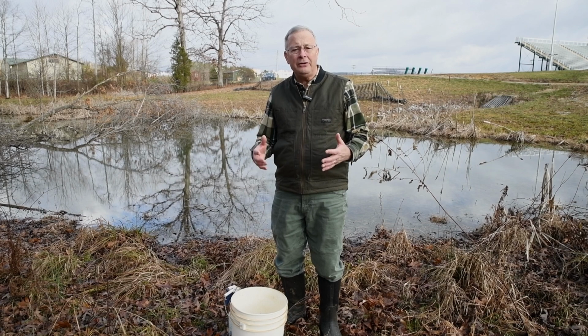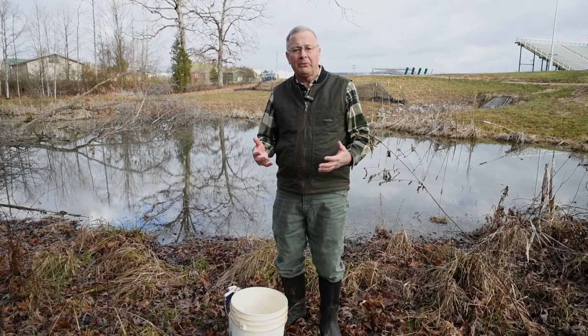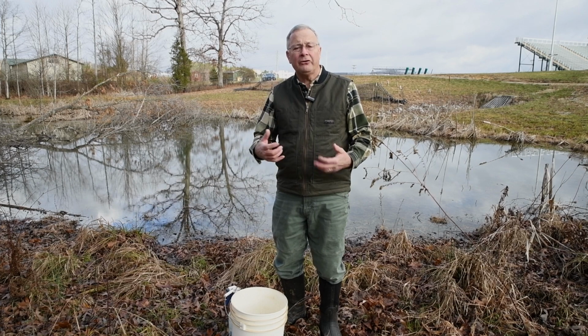The clay must have ideal moisture content to compact. If it's too dry, you can't compact it. If it's too wet, you're not able to compact it. And there's a simple test that we can use. You just grab a handful of the clay and let's watch and see what happens.